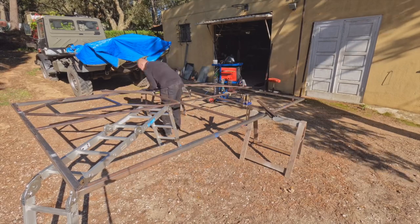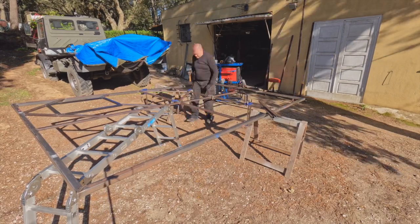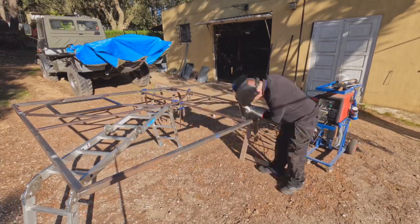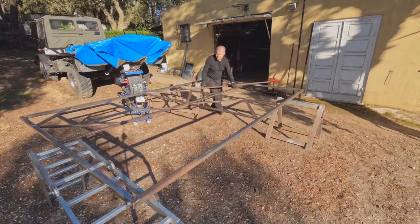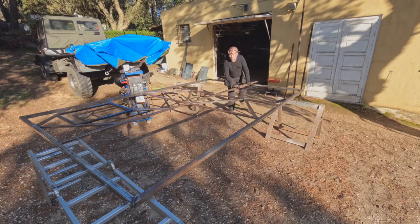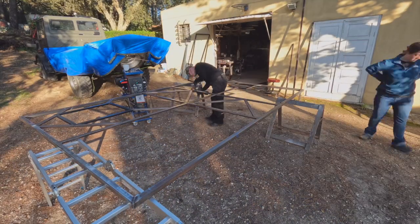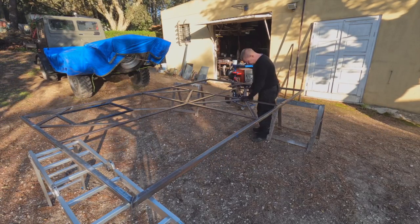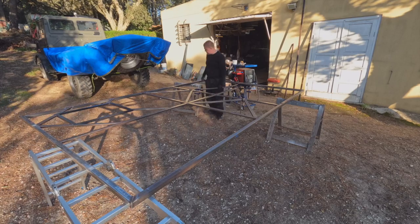The process should be familiar by now. Clean the weld spots, clamp everything in place with an excessive amount of clamps, tack weld it in place. With the zigzag in place, it's now pretty obvious that bracing to the zigzag points from the hatch corners is probably a good idea. Let's actionate this blue sky thinking with a magical synergy potion.